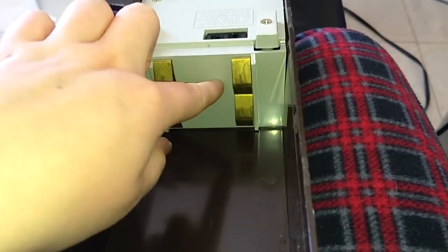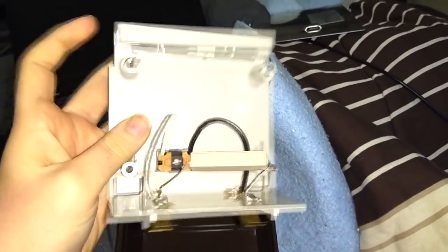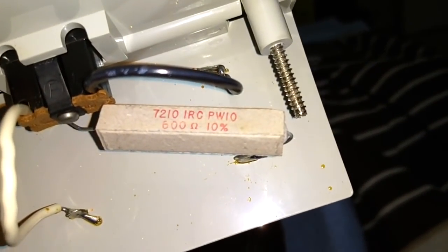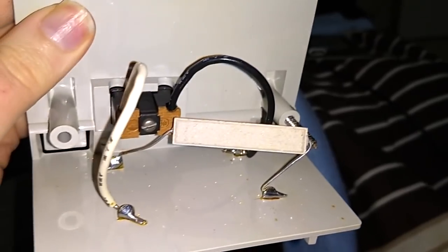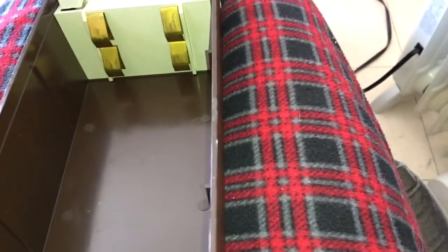And so there's wiring inside this thing, and I took a picture of the inside of this, which I'll show now. You can see inside this thing there's a little wire to connect the batteries in series. Actually, it's not a wire, the resistive ballast is used to connect the two batteries in series. So the resistive ballast actually is placed in between the batteries, which is a little bit weird, but it works. And you can see the connections to the outlet there. The outlet is literally a standard off-the-shelf component. Very, very cool.